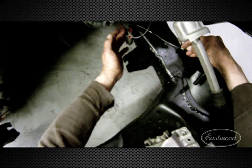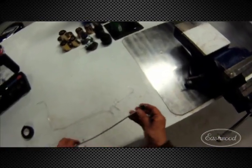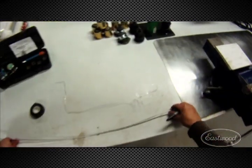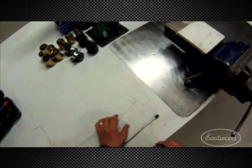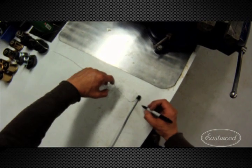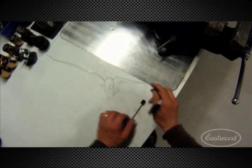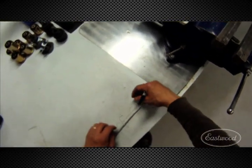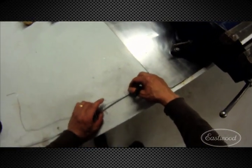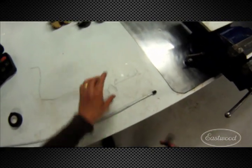So let's go make that. This is the line we just flared — we've got about three feet of it. What we're going to do is get some marks. You can accurately do this: go to the center of your bend, approximate a bend radius, get a couple of marks for the geometry. We know we want to start our coil right about here.